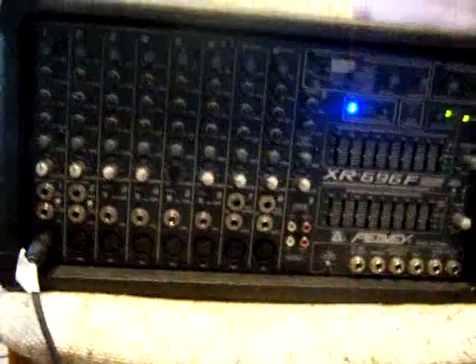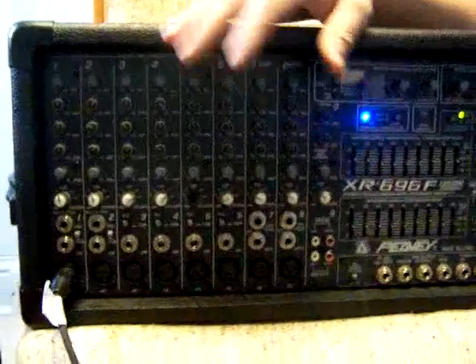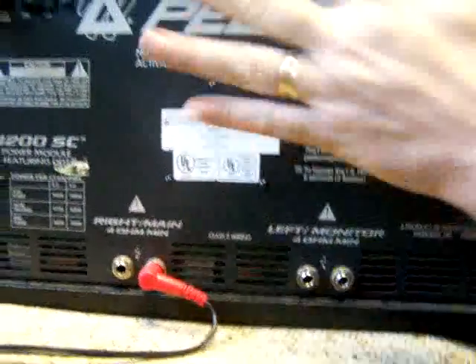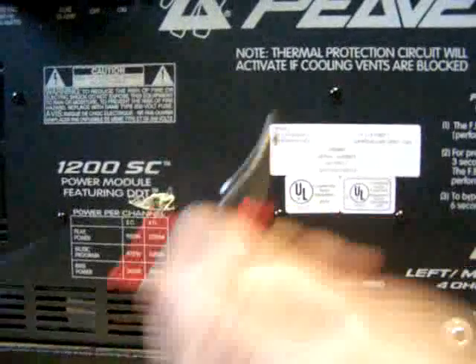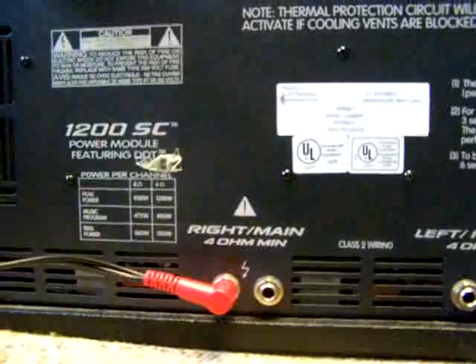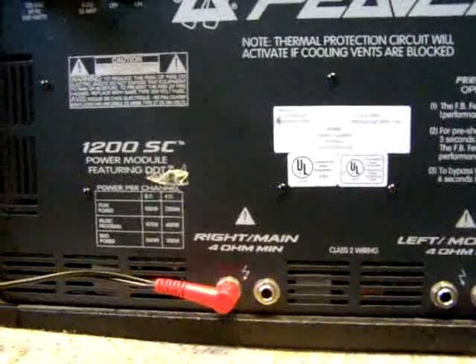This next thing is really important. Whenever you work with this, the front of a box unit is all low power. The back is where you plug the speakers in. You never want to take a microphone and plug it into the back or anything else — power is always on the back. All you need to do is where it says left side or right side, that's where the speakers get plugged in. It takes a quarter-inch jack — just plug it in, it gives a little click. Make sure you use a speaker cord after the amplifier. Anything before it is a regular high-impedance or instrument cord.